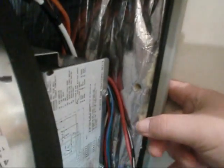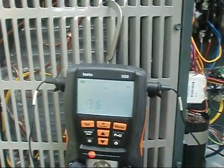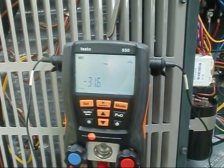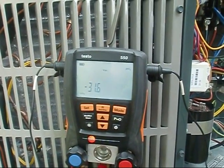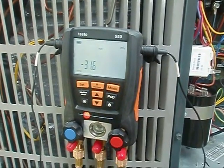I'm floating in there and taking a wire through — I got lucky, there's already a knockout there with a little rubber bushing in it. We're breaking the yellow wire here, and that'll kill the outside unit if she overflows or stops up. I ain't got a micron gauge, so I'll hear about that, but negative is negative. That's negative 31. This has been evacuated three times now, so we're taking it to the next level over here at Carl's.